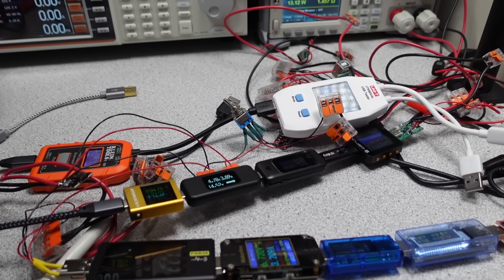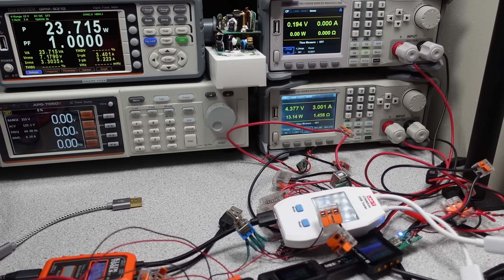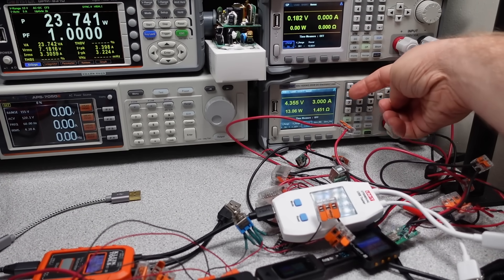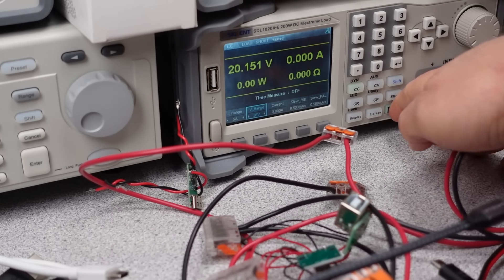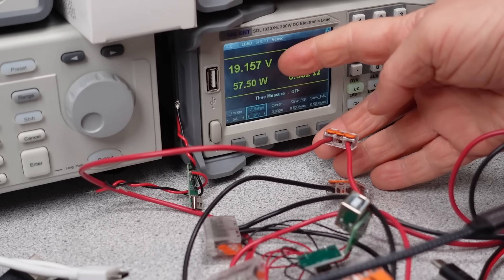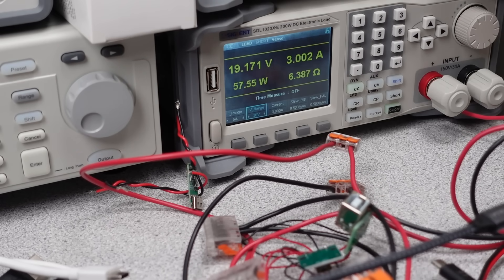The series resistance values do remove some connector resistance, so I had to use a cable to subtract the system resistance. These values are a little bit optimistic, but they work for comparison. The product of the current and the voltage gives you power — the power of the circuit, which is a very measurable and limited quantity. You are most likely going to be limited by the power adapter, the cable, the device, and then the meter.